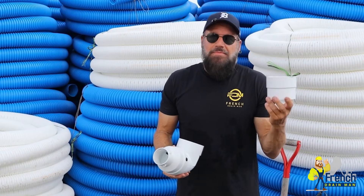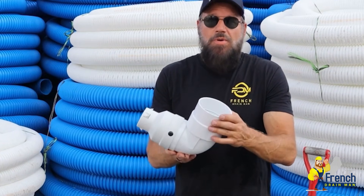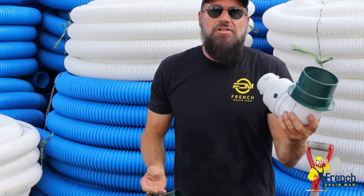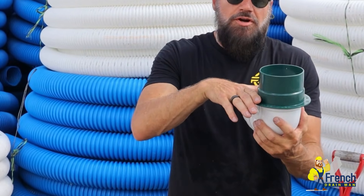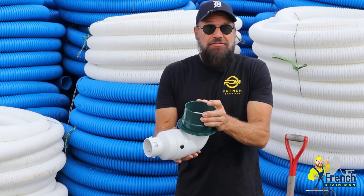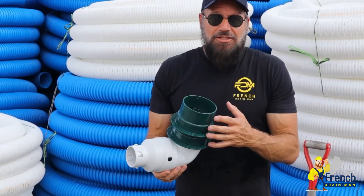Pop-up risers have typically been made of PVC. The problem with PVC risers is that these big zero-turn lawnmowers with operators on them weigh so much that they crack them. So what we did is we designed an HDPE riser. It gives you two-inch lifts, has a flange, no tools required, no glue required. When you backfill it with dirt, it's not going to pull off because the dirt gets caught on the flange. This flexes — it has a lot of give and can't be broken by lawnmowers. In the wintertime, if you have a pop-up freeze-up, this will expand and contract with the freeze-and-thaw cycle.